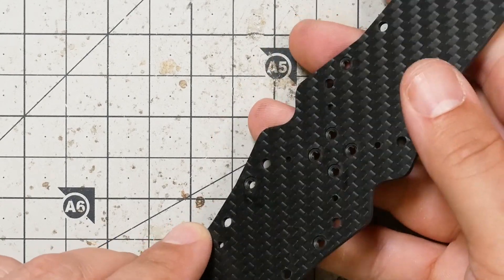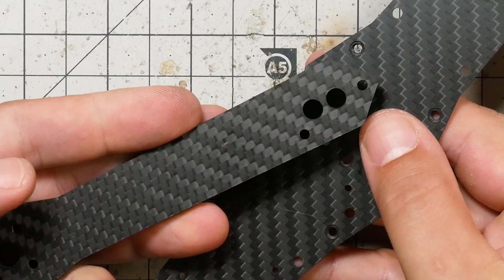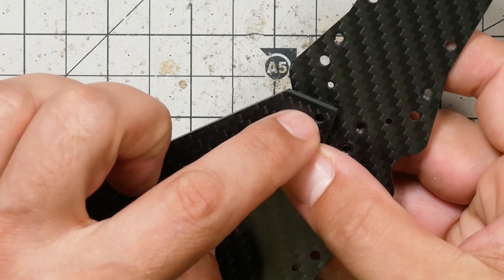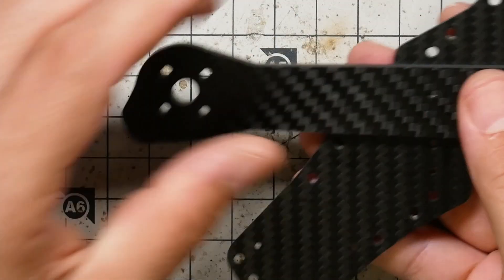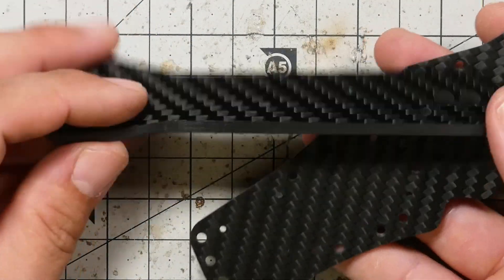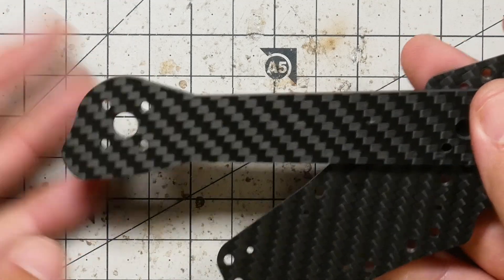What I want you to do is take the bottom plate with the press nuts facing down, and take an arm and lay the arm on top of the bottom plate, and find such that the two small screw holes here and here line up with the threaded holes. That's going to be done such that this little foot faces the back of the QuadCopter. So if yours is like this with the foot facing out to the side, then that isn't correct — you've just got to flip the arm over.